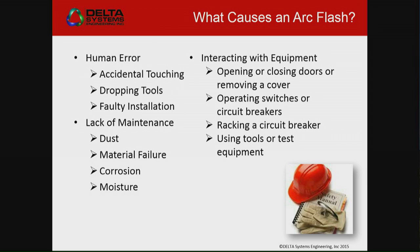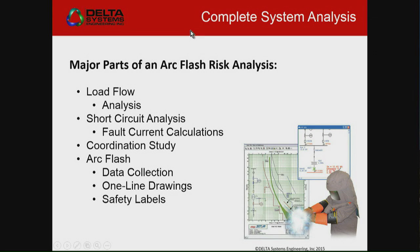In going out into the field and trying to collect data to produce a good model, you have to keep all this stuff in mind. All of your workers need to be trained — this is more than just the model, there's an actual physical component here. When we go and do an arc flash assessment, we want to make sure we do the complete system analysis. You want to make sure that you don't forget your load flow analysis — you want to make sure that your model is absolutely correct, that anything that pops up at this point, like undersized cables, will tell you to go back and look at your model. Make sure it's correct. Make sure you run that load flow analysis.